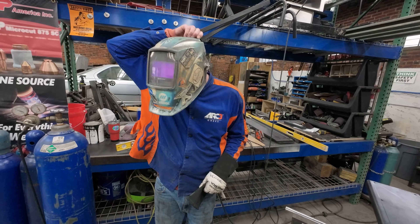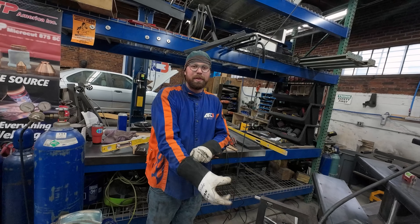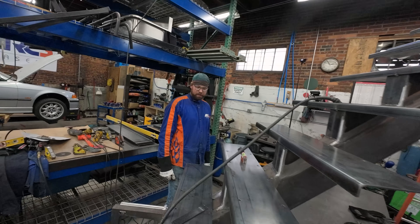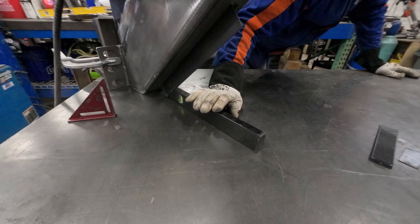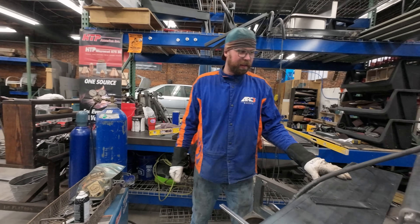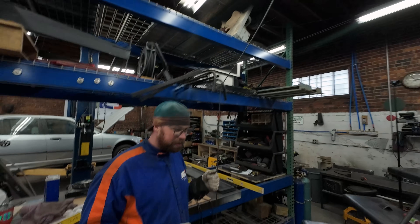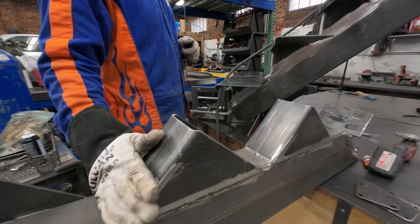It's been time-lapsed for a while — might be good to update the people on where we're at. Doesn't it look like stairs? It looks sick. There's a lot of moving parts to this thing. The key here is just using the angle finder against the table, making sure that it's 40.1 degrees thereabouts. Then we just level these treads as we go. We're supporting the treads from the I-beam with a chain hoist, which allowed us to fine-tune the height and dial it in pretty good.